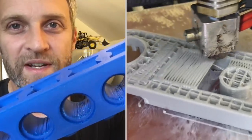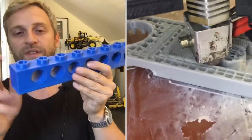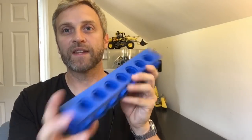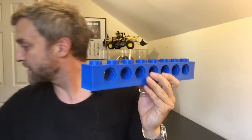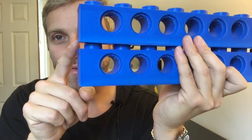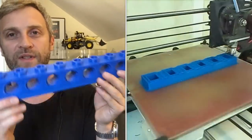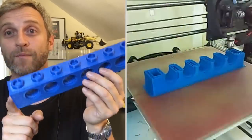If you get up close they're fairly rough to look at. On the inside, as this is all bridged with no support material, you can start to see some of the bridging material that had collapsed on the back side of these holes. I just cleaned them up with a knife afterwards to round them out — a little bit of cleanup required. Here's one that did peel; you can see on this corner how it pulled up off the edge of the bed. My PEI sheet had got a lot of bubbles underneath it, so I replaced my bed and that fixed this problem.